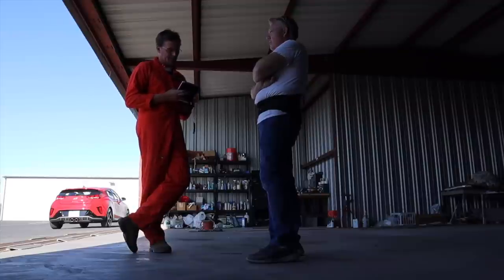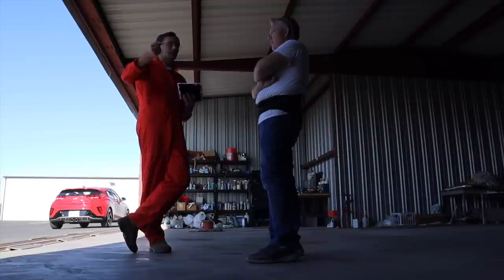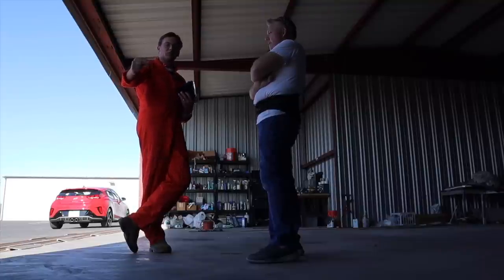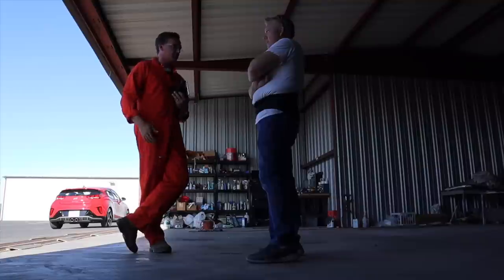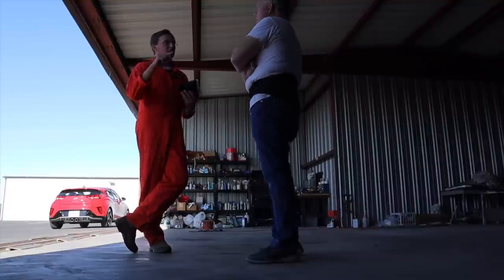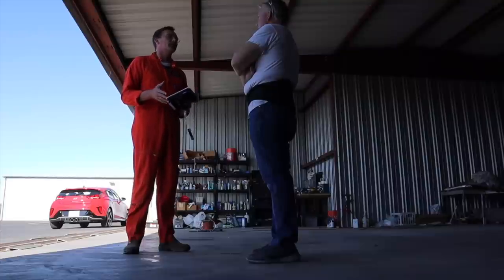Full range, right? I had leaned to try to keep it below 1300, but it was like this much range to go from up in cruise. I could get 1100 EGT to 1300 was like that much, and then from there back was like 1415, it happened really fast. So it was really hard to get it right at 1350, which is what I was shooting for.